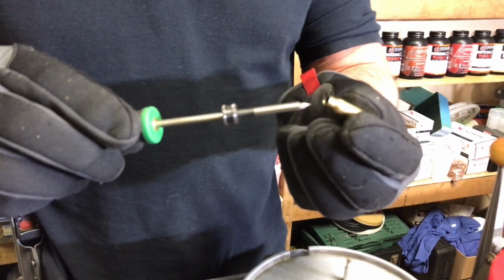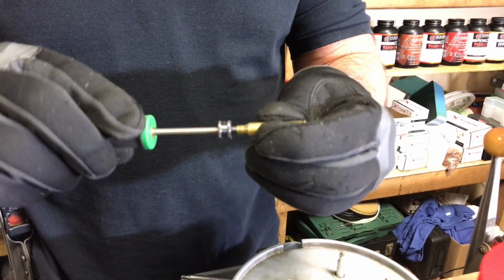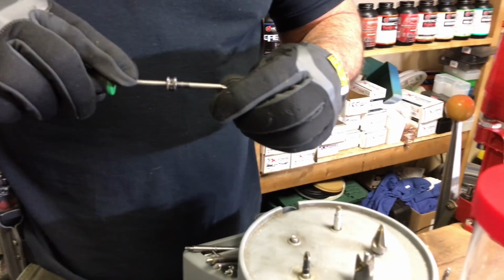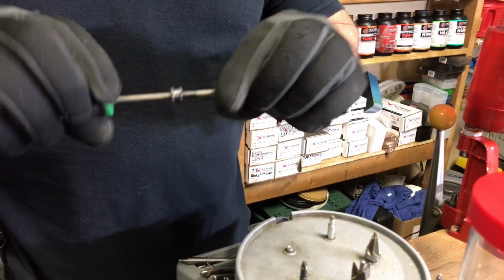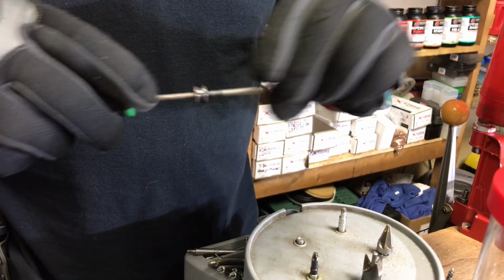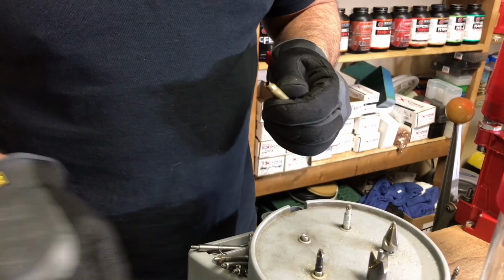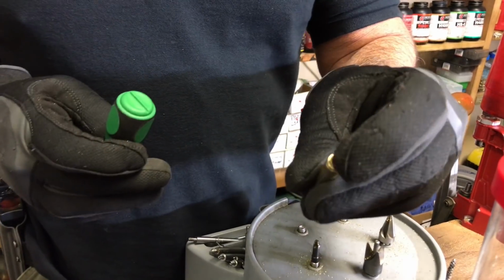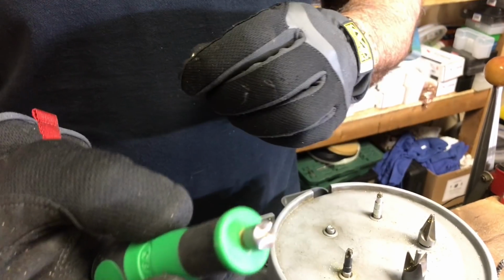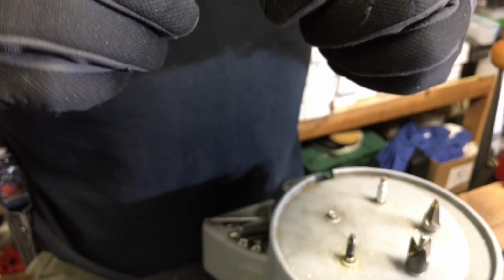So I'm going to uniform my primer pockets and my flash holes with my little RCBS tool. I do both sides. I do from the primer in, I do it real light. I'm just making sure everything's clear. Then I want to check my depth on these primer holes. So I have this little tool. It cuts your depth. I just spin it around there.